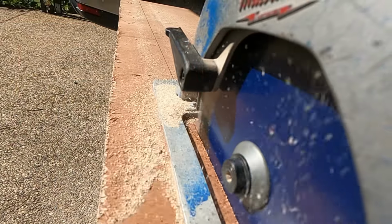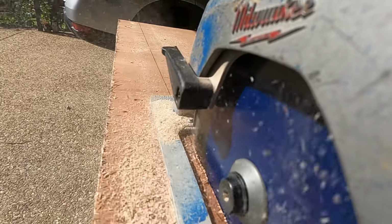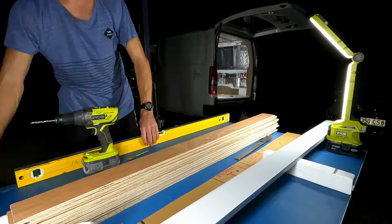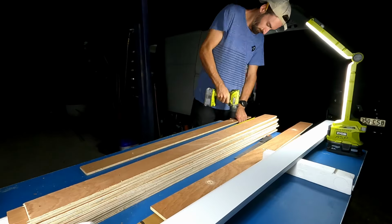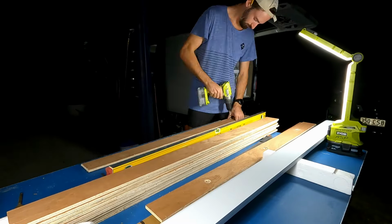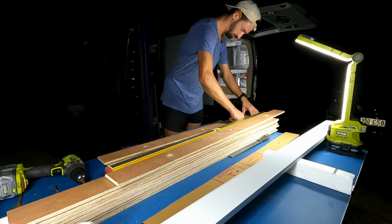So you start by cutting these 1220mm lengths by 100mm to create your strips. You can do this with 80mm strips if you're quite confident with your impact drilling that you're going to be able to place everything accurately. If not, just go for 100mm to give yourself a little bit more meat to drill into.